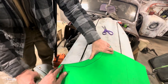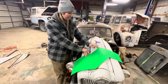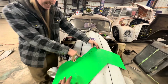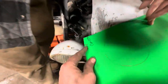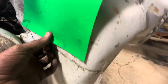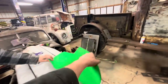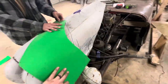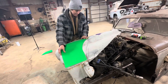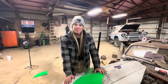We're going to arch it up to a point first, and if we don't like that, we'll cut it right behind the headlight and go straight. What we did was she drew what she wanted on this green piece of paper, and I said I don't like that let me try again — and it was exactly the line underneath. So this will be our jig — we mark center at the headlight, on this body line, and then we can flip this over to the other side for a matching line. Let's cut it.